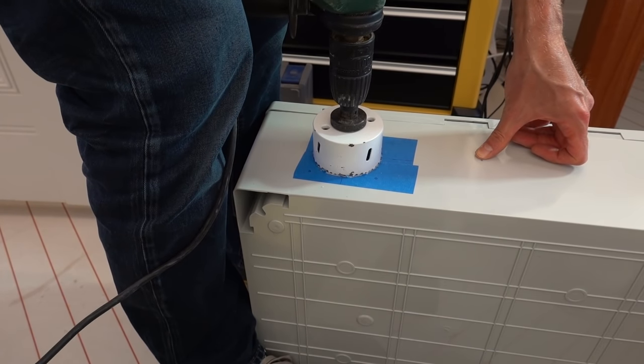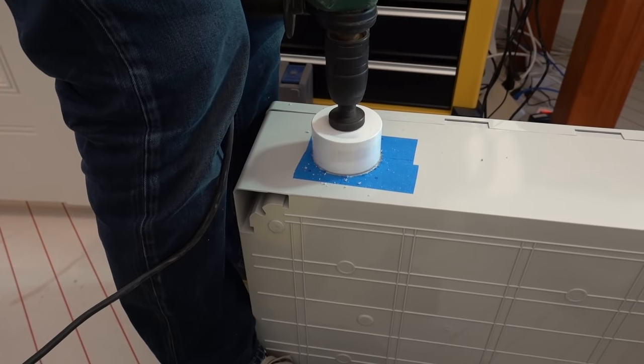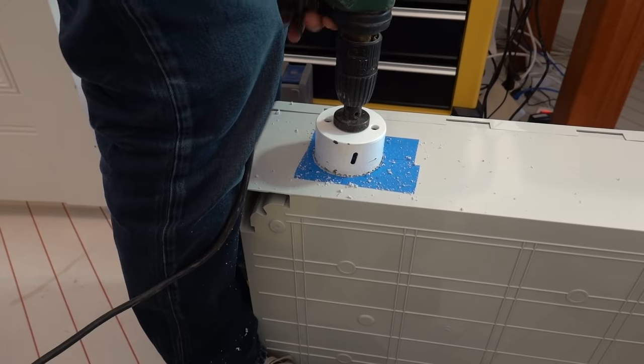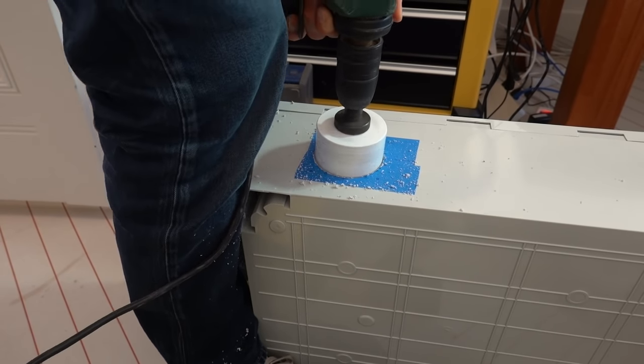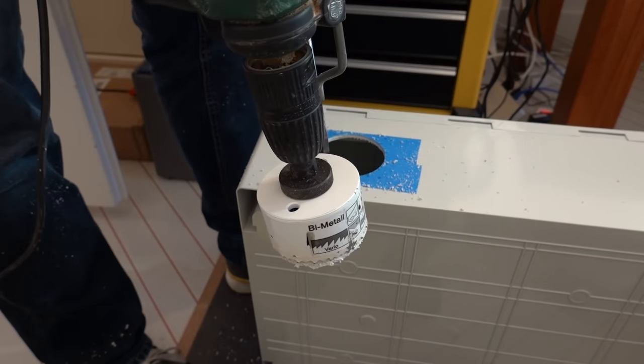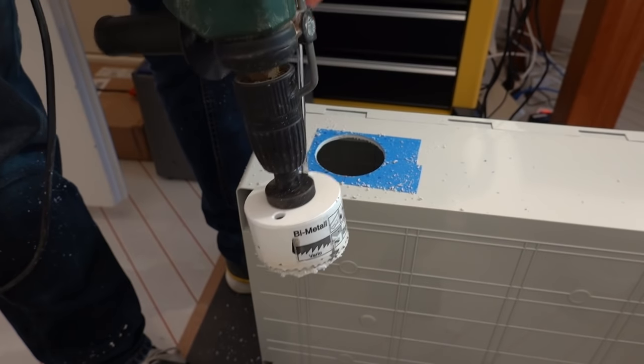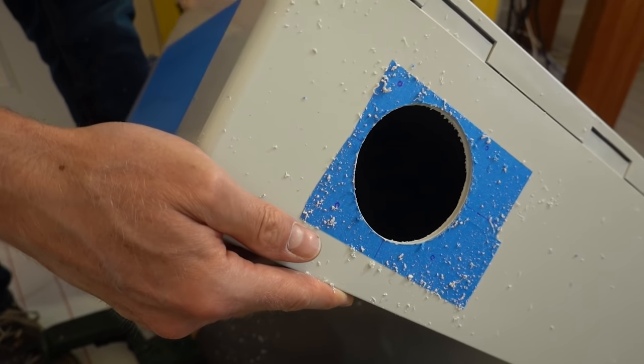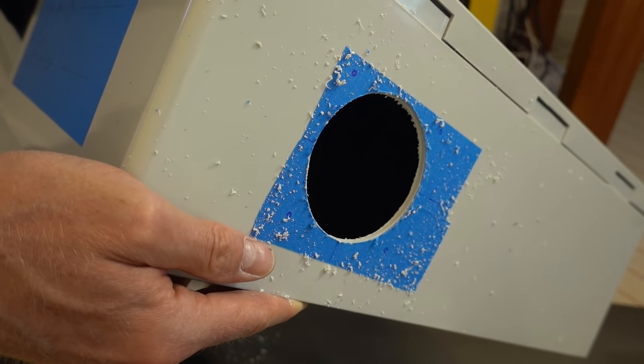I used an old drilling machine for the hole saw. But the problem with the setup is that the drill doesn't have enough power and the RPM is too high. So either I am melting the material or the drill seizes up. This is not good practice, but with a bit of wiggling and applying alternating pressure, it still works. The finish on the hole is not very good, but after some filing, I think it's acceptable.